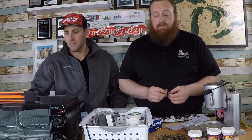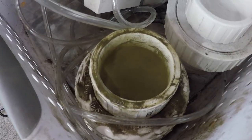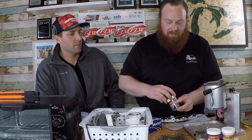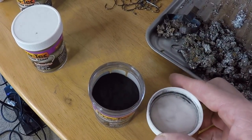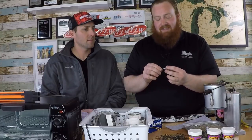To paint these lures I use what's called a fluid bed. It's a simple system that injects air under the powder paint through a small filter, fluffing it up instead of leaving it as a dense hard blob. If you've ever let these paint containers sit over winter they go completely solid — even tapping them they don't move. When you dip a jig into that dense paint you get a big glob on top and nothing consistent down on the bait keeper.